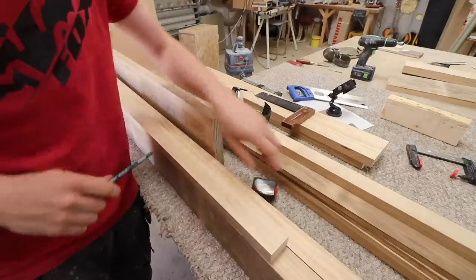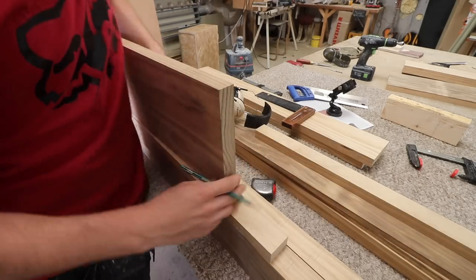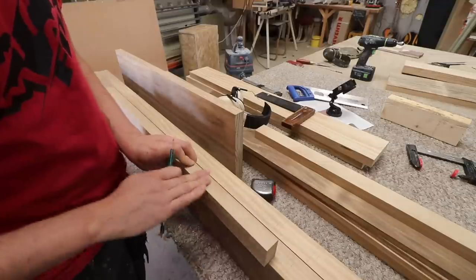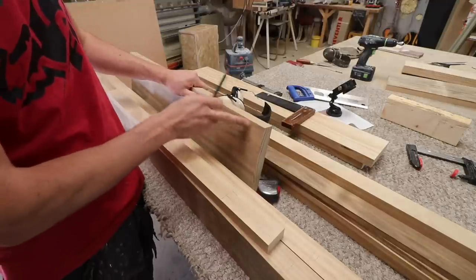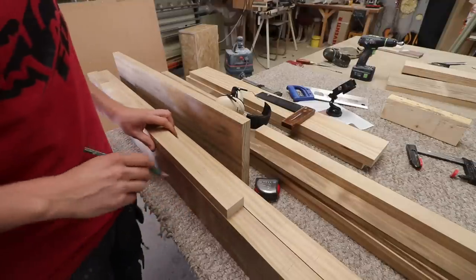So that is the position of our tenon, dictated by the thickness of this rail off of the back edge of the door, so the side that we've designated as the face. So this is the face of our pattern piece. So we're working from this edge on the bed of the tenoner, and we're cutting our tenon in a position where the top of that tenon meets this piece of timber. So we'll stick that on the machine and set it up to them settings.